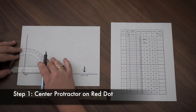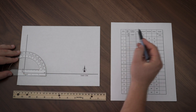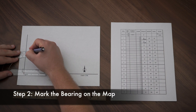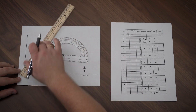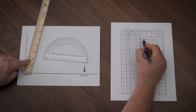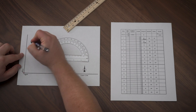The first step is to center our protractor on that red dot. Notice that as I'm centering it, we can locate where 90 and 180 degrees are marked on the table. Then we look for station one and the bearing, which is 99 degrees. I mark 99 degrees on the paper using the protractor. Then I remove the protractor and bring in my ruler, centering it at the station dot and measuring out to the 10 centimeter mark — because it's 20 meters, or 10 centimeters on this scale. I put a dot there and label it number one. That will be station number one.